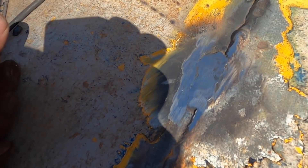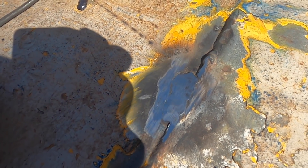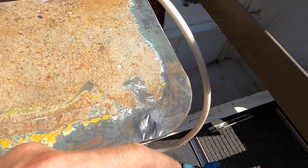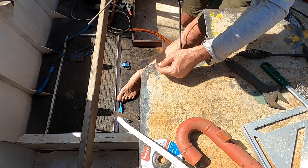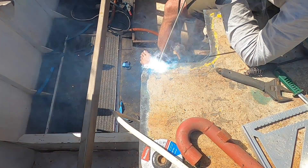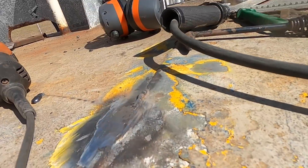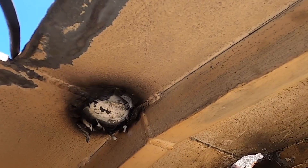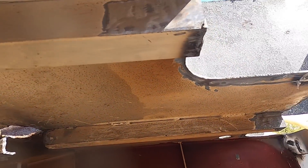So you can see the idea essentially: take a depression that's not all the way through, build it up with a relatively cold weld, and then you can blend it into the old steel. It's just a much better alternative to an epoxy putty. Another one here just outside our cut zone - may as well pad weld that too. I find it best to start where there's good steel and come across it, otherwise you'll undercut, get slag trapped and all that kind of thing, so move right across the divot. Let that cool for a bit, we'll chip that slag off. It's worth noting with this one here, obviously you're going to burn all your paint off underneath, but that's okay because we've got heaps of painting to do under here anyway when we put the new plates in. So better off doing it now before you paint, otherwise there'll be tears before bedtime. Chip that one - big splurge of metal, but high enough that we can grind it smooth, then paint, high build primer, couple of coats, sand, paint, whatever you need to get it to look good.